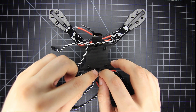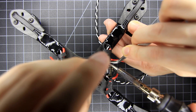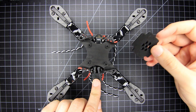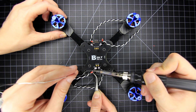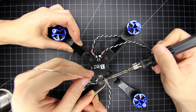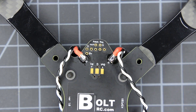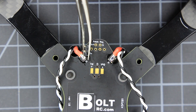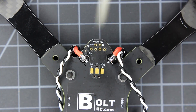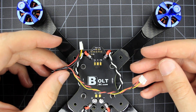I'm just clearing the wires out a little bit and adding some heat shrink to help organize things. Go ahead and solder on the ESC power wires — ground on bottom, positive on top. Once the grounds are done, install the battery pad. The camera and VTX wires can be wired to these 8V through holes here. You also have the option to install pin headers to use a connector and make the pod a quick disconnect — if you do this, the pins will have to be at an angle so you don't hit the camera. I decided just to make a quick harness and direct wire it.